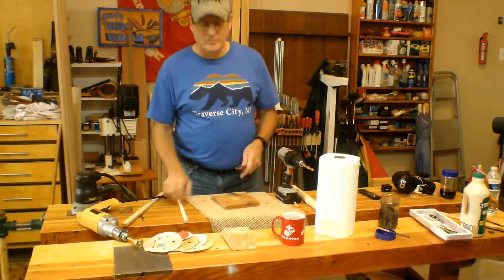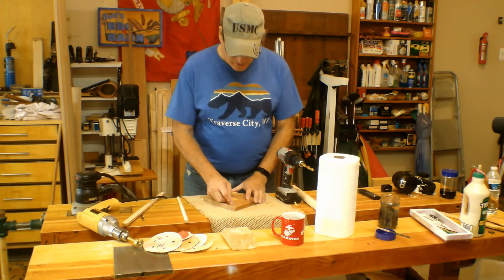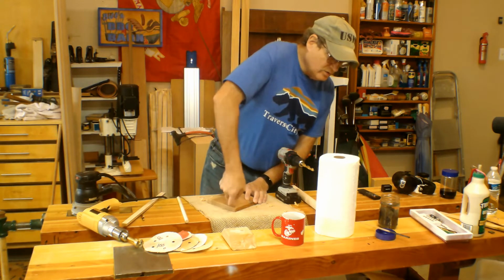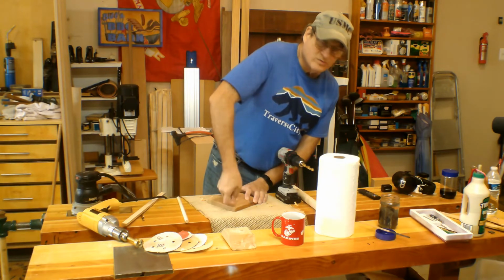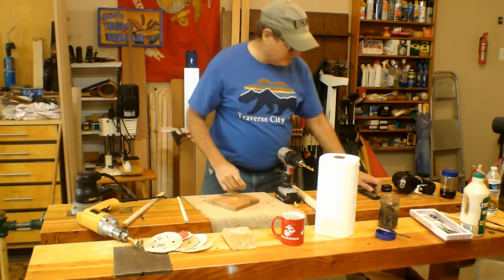All right, for my 1/2 inch dowel, I have my location marked. All I'm doing here is using my birdcage awl to get a starter hole. Push down 3 or 4 twists. You have a nice little spot for your drill to start.